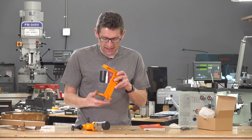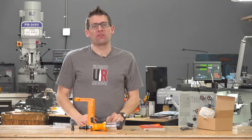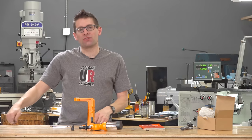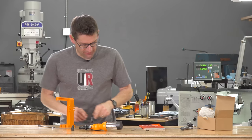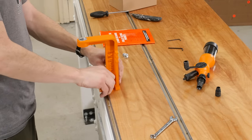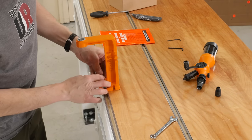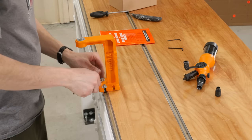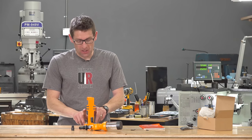I quickly sorted out the ideal mounting arrangement. I've got the Ultimate Reloader Bench System here, which uses T-tracks and 3/8x16 bolts — the heads of which slide in these tracks and then you clamp things down. These slots are optimized for quarter-inch bolts, so I found some large-head quarter-20 bolts, shortened them, and now all I have to do is slip these into the tracks. The challenge is keeping them from spinning because they have round heads, but if you kind of pull up on it, it doesn't move as bad. That is solid, and I needed no base, no other hardware — just a couple quarter-20 bolts and I'm set.